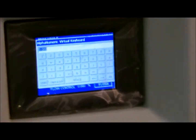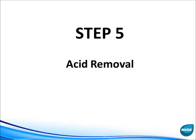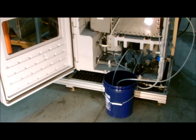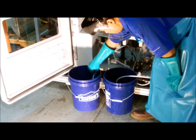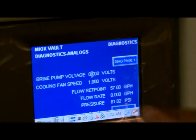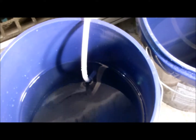return the brine pump voltage to zero. This turns the pump off. We will remove the acid bucket and install the soft clean water bucket. This will be used to flush the cell. Note that the acid bucket and the fresh water bucket are the same.